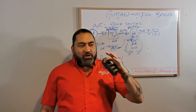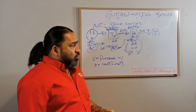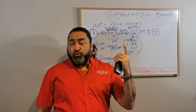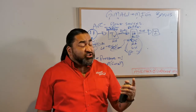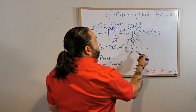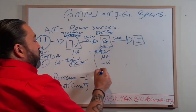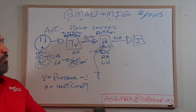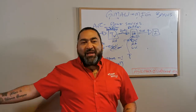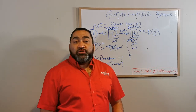Now you'll buy a welding machine today and most of the time you're going to be buying some form of inverter. The biggest giveaways when you're looking at inverters: one is price - inverters tend to be more expensive, though that's changing drastically - and two is size. In order for all these to exist, there was always an underlying issue: the loss of power through grounding. Every system here has a ground that goes back out the outlet into the wall, which gets spiked into your copper pipe in your house that goes into the ground. We need that for power storage surges or unused power reservoirs.